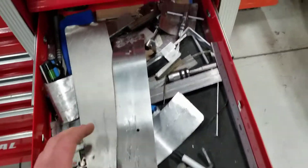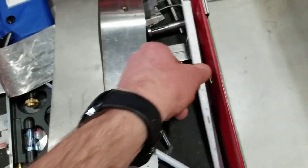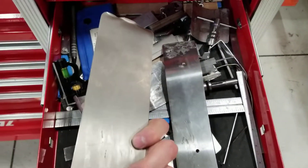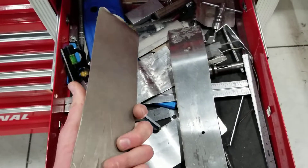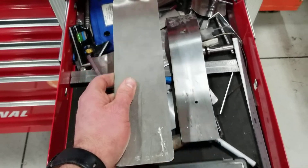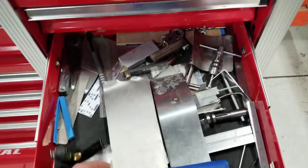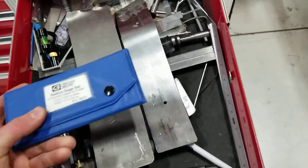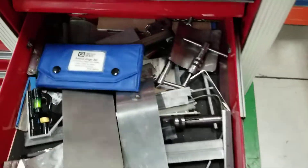Next drawer down is kind of a messy drawer, but a lot of it is just a couple of measuring tools. I got calipers, a lot of gauges, and then a lot of steel that I use. When we pull stringers in and out of airplanes, we kind of protect the skin by sliding this under a stringer and then as we pull the stringer out, we slide this with it. It really helps keep the stringer from gouging the skin since stringers do have sharp edges. Radius gauges I use all the time when we're doing doubler repairs and whatnot.